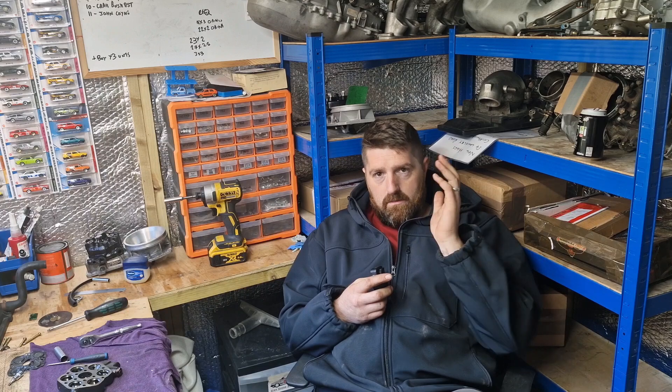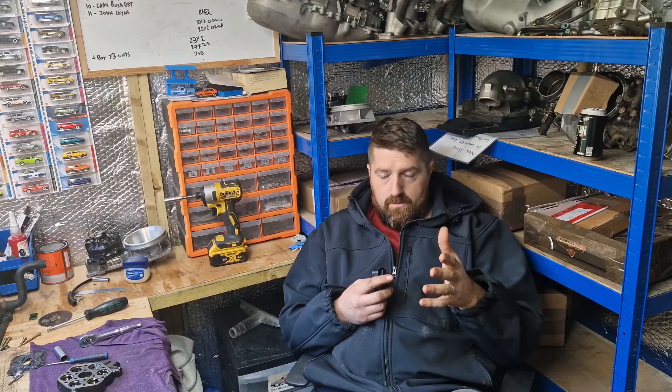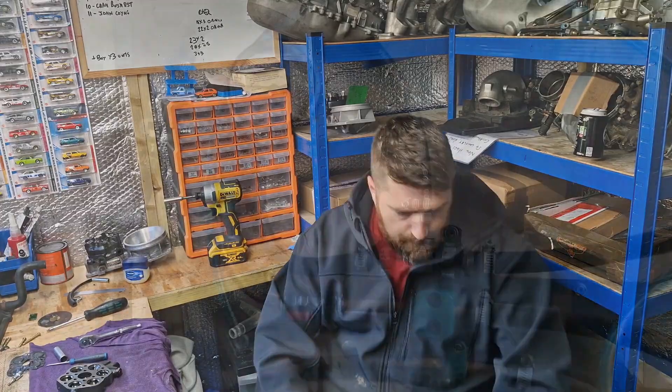We've got a typical RS Turbo unit here on test — just rebuilt it, rock and roll. The differential pressure is fine on that, but I'm going to show you what it is, how to take it off, and I'm going to over-exaggerate the adjustment. Our magic number is between system pressure and differential pressure: the difference between the two should be 0.4 bar. That's what we're working for.